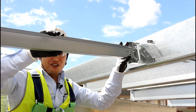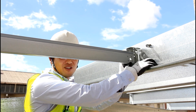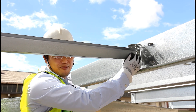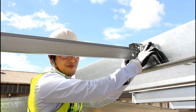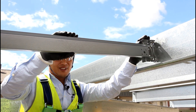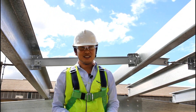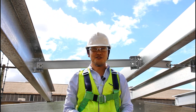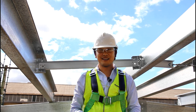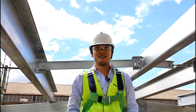Next I'll spring the bridging around, and if we look at the purlins on this side you'll see the two locator prongs from the preceding bridging. The lock on the intermediate bridging will go over the top of these two prongs — again you should hear it click. The bridging is now locked in place and secure. You can see how fast and easy it is to use our bridging system. I can now continue moving from bay to bay installing the intermediate bridging until we get down to the fascia.